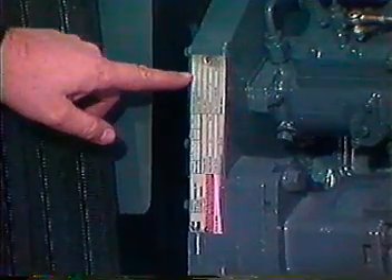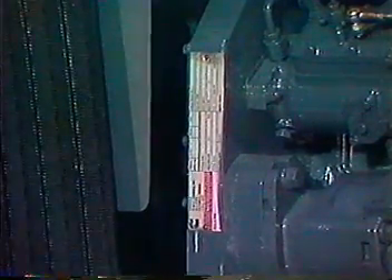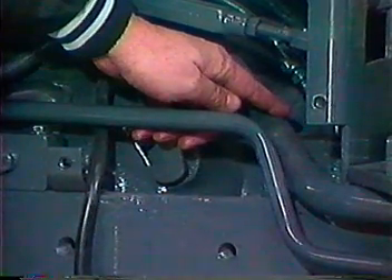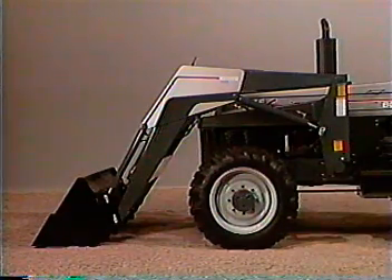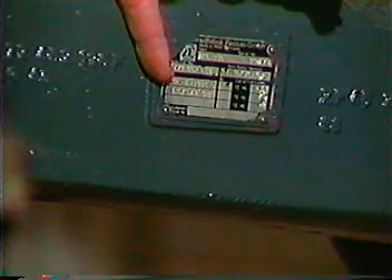Serial numbers are stamped on metal plates or directly into the housing. Tractor model and serial numbers are located here. The engine serial number is attached to the timing gear housing in front of the injection pump. If the tractor comes equipped with a three-speed power shift transmission, that serial number is stamped directly into the housing near the breather filler. If equipped with a White farm loader, the serial number is on the inside of the left-hand boom arm. Also record the serial number on the power front axle.